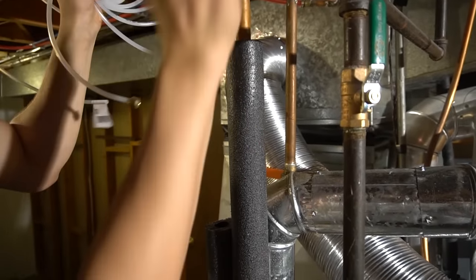The humidistat's in. Next we're gonna just do all the wiring starting from the transformer. I'll just punch one of these knockouts out, then I'll spin it in here and hook up the low voltage wires to here, and that's where we're gonna get our 24 volt feed. It'd be nice if I could put it on that side, but I would have to move the water heater for that, and of course we don't want to do that. So that's what we're doing next.